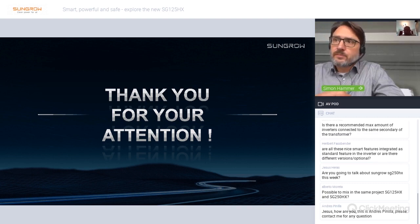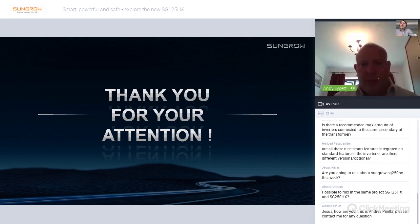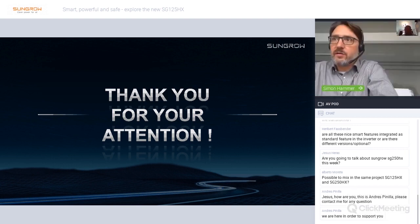Wonderful. And is it possible to mix the SG125HX and the 250HX in the same project? Yes, as mentioned in the presentation, this is possible. As we have the same AC voltage here for both inverters, 800 volt, this is possible, yes. Wonderful.